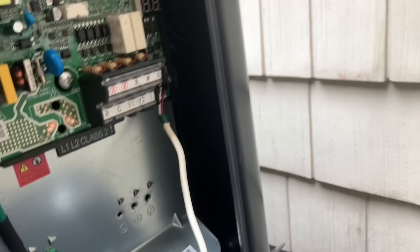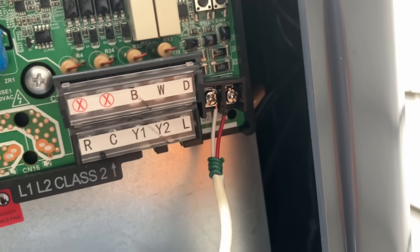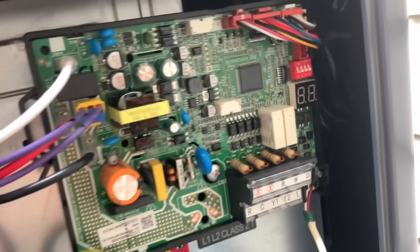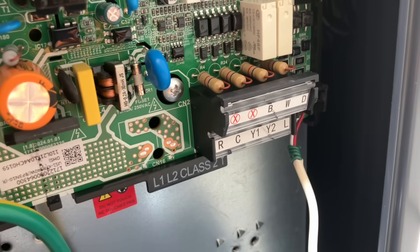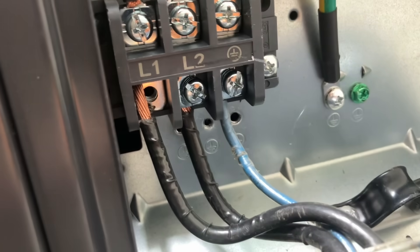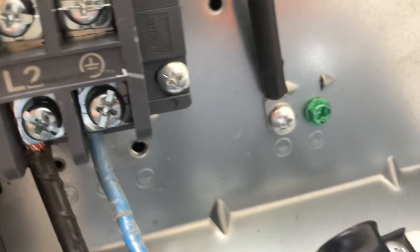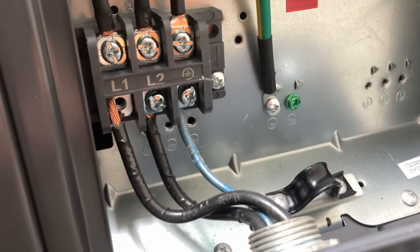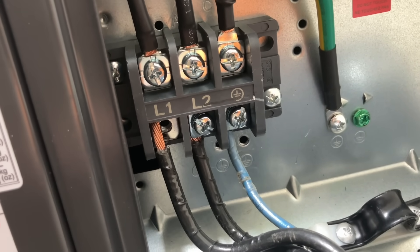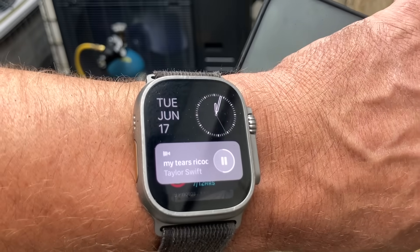I am wiring up the communication wire — it's a two-wire communication wire. It goes on those two terminals right there: one is on the right, two is on the left. They claim it's non-polarity, but stick with the colors — trust me, been there done that. Tech tip: when hooking up your whip to the L1, L2, and ground connections, remove the screw completely, put your wire in, then guide the screw on with your magnetic screwdriver. Don't fight with it — just take the screw out on the terminal completely and put the wire in, then put your screw in. Easy peasy.